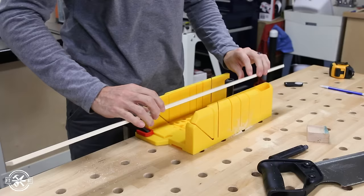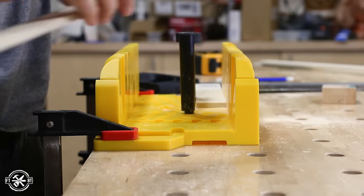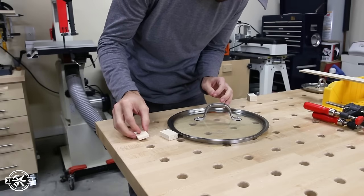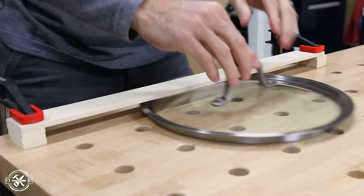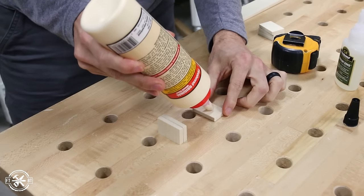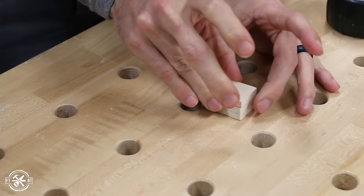The main part of the rack is made a half inch shorter than the cabinet opening. This will leave a quarter inch on both sides for clearance as the door closes. I sanded the piece smooth and broke all the sharp edges before assembly. Before putting the rack together, I did a quick mock up to make sure the lids would fit. Three spacers was just enough for my lids, but make sure you test your own to get the right height. I glued the three spacers together using a combination of yellow wood glue and CA glue. The CA glue gives a good quick hold and the yellow glue will give it strength when it dries over time.